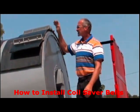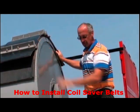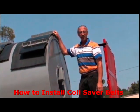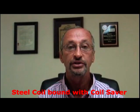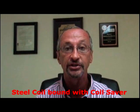Start your chain process in the middle, forward or back, either or. Transferring 3 chains from here up here increases your load at capacity of close to 50. Now we will simulate what happens during an emergency stop to both the coil and the truck, with the chains being bound with coil saver. During this demonstration, note the increase in pressure it takes to break the chains during this situation.